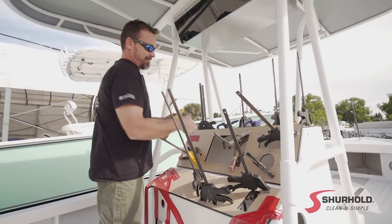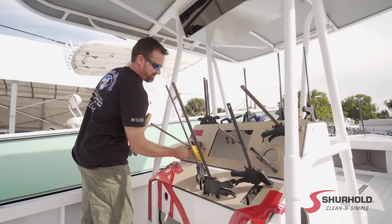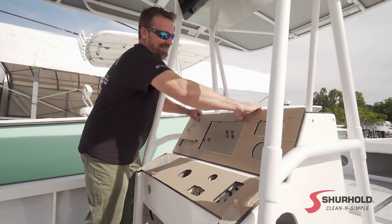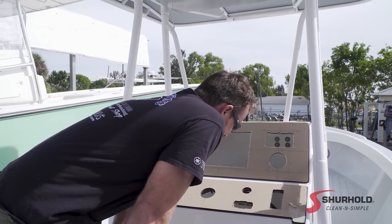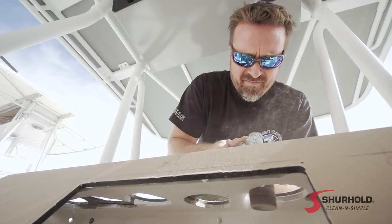After we waited our 24-hour period, we were able to get up on the boat. Very complicated procedure here — you've got to be careful removing the clamps, you don't want to drop them. When you're removing the clamps, you're looking for the 5200 to look like you had a good seal, so it usually oozes out evenly all around your opening. This way you know you got good adhesion. After everything's all removed and said and done, I gave it a final look and noticed I needed just a little bit of touch-up work, so I used my barrel sander to make sure everything slides in nice and easy — you don't want to snap your acrylic.